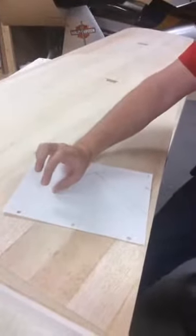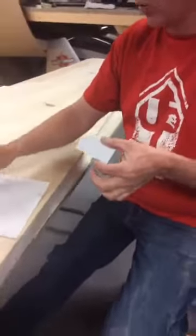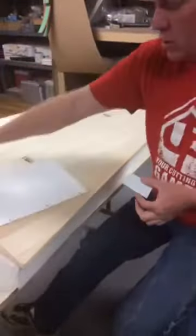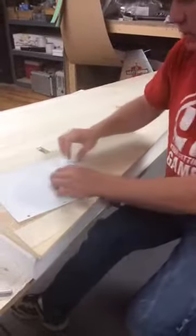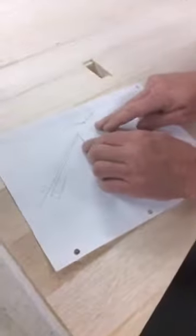What I do is I come up with the thickness of this material right up here in this block. And then I mark it out with 3/4 inch or 1/2 inch or whatever your stock was in there. Then I made this little jig here that has these reference lines to how thick that was. Now, this is to the edge. This is 3/4 inch block. And what you're going to do is take that and perfectly zero it, just touching this little edge. You're going to sweep up here until it touches, and then you measure over.